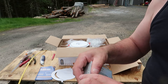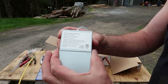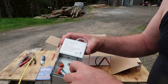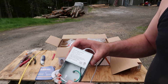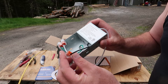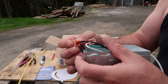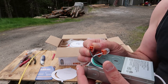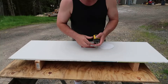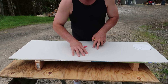There's a little adjustment here that goes from 2700K to 5000K on your lights. It's got two knockouts on each side. To open it you just press the little dimple on each side and open it up just like that. The best part about these lights — what makes it so simple — is these little connectors. Once you strip your wire you just plug it right into there and you're done, then move on to the next light.